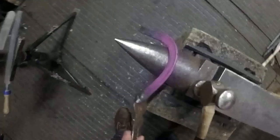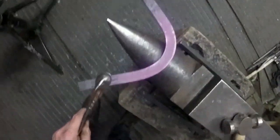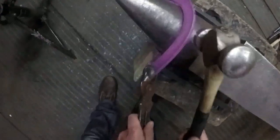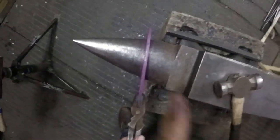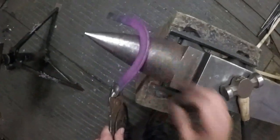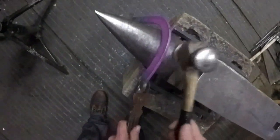So I'll make this off the hammer. Won't bother rasping it up. So you're going to run round the bick. Quite a big toe bend, so run round the wide part of the bick up there. Just very lightly tapping it. You don't have your steel on the anvil at 90 degrees, you have it leant over fractionally. So the anvil works that edge off and your hammer works that edge off, and then you swap it over and do it the other side.